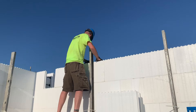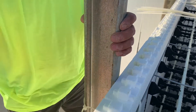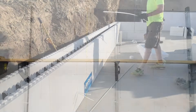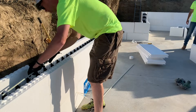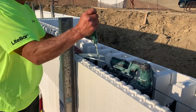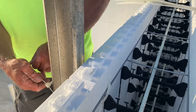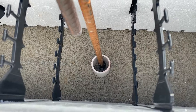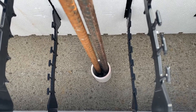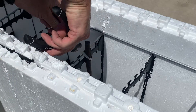Continue assembly to full height, adding zip ties every 32 inches and anchoring the form to the exterior vertical braces. Reinforce all common seams with foam glue and/or lumber. Place horizontal rebar as needed between the window and door openings. Install steel in-wall bracing along the top of the form. Install zip ties at the top row of spacer ties and anchor the vertical braces. Place vertical rebar by lowering it onto the PVC collars at the bottom of the wall. Rebar should stop approximately one inch short of the top of the assembled wall, and zip tie it to a spacer tie or the steel in-wall brace to keep it from shifting.